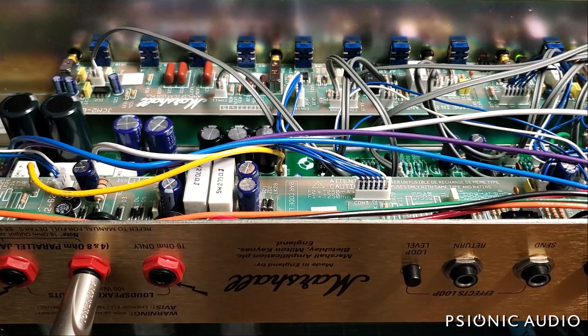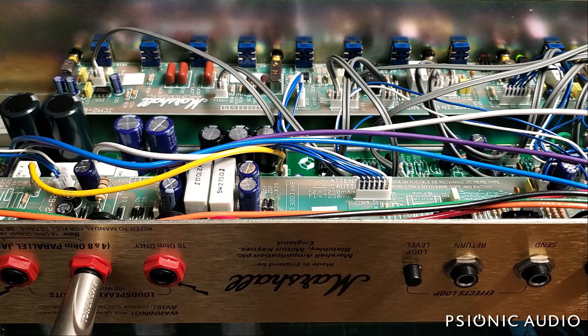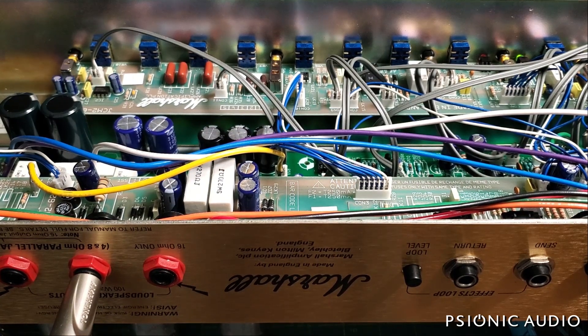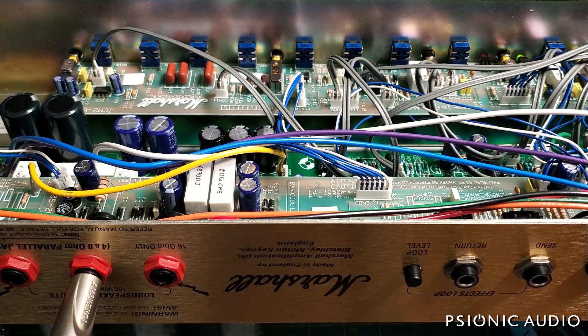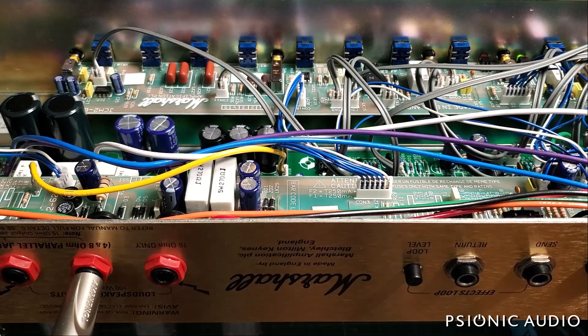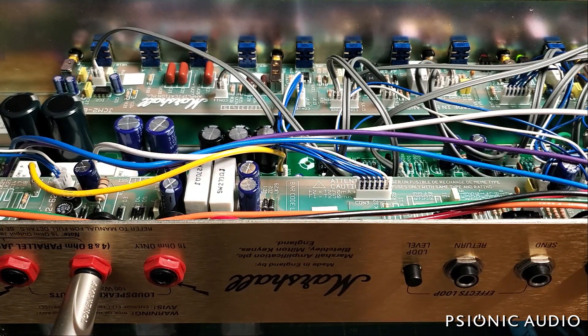After all of that, the amp had come in with some mismatched old power tubes that had bad scorch marks — those are trashed. It's got a new matched quad of Mullard EL34s in there. I really like those as far as current production EL34s go — they've been very reliable and sound very good. I got it all biased, which is a pain with this circuit because it has different biases for each side. The trim pots they use are very flimsy, it's hard to reach the adjustment spots, and if you adjust one side the other changes as well — not the best design for a dual bias. But I've got that all set. I'll need to let the amp run for a couple hours before I decide it's good, in case the bias starts to change — this model is notorious for that, and the new board is supposed to fix it.